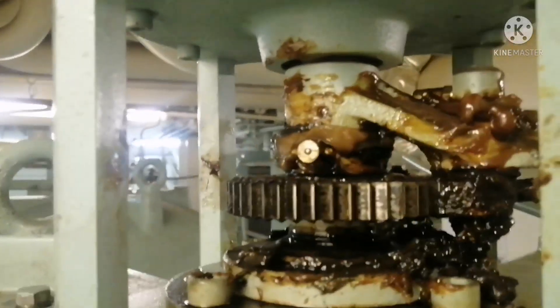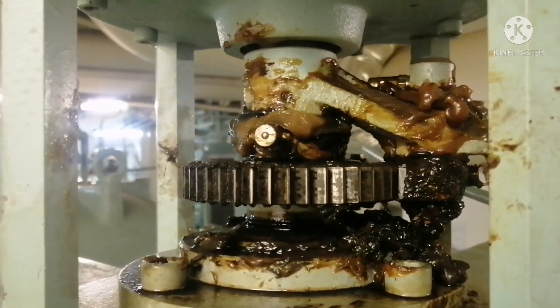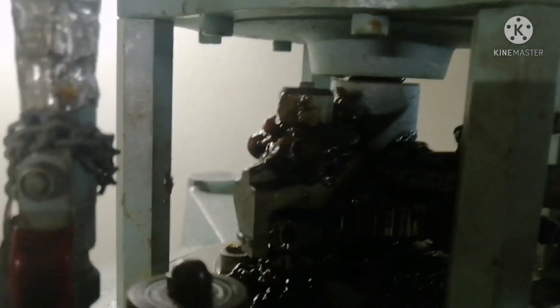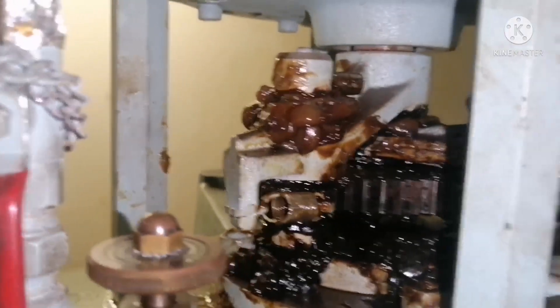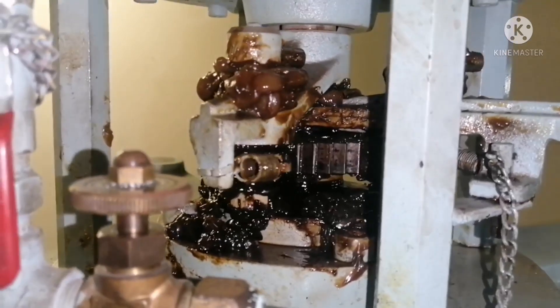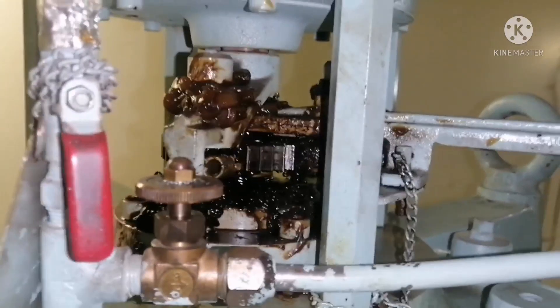The main thing is you have to see the gear is turning — when the gear teeth turn, that means your filter is turning. You have to ensure the spring for operating this gear should be in good condition and well lubricated. You can see there is a spring that should be in good condition, and the teeth should be in good condition, and whenever the movement is happening the teeth should move.